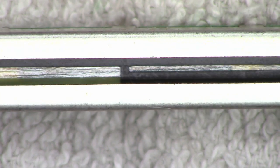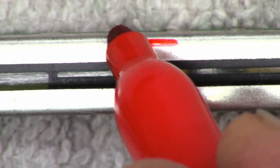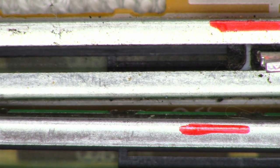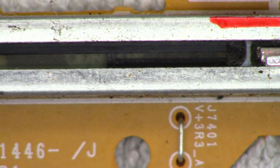Here's the new one oriented in the exact same way, and that's how it's going to go on. I'm going to go ahead and make a mark on the pot where the connector should be — about right there. Now these two pots should be virtually identical upon reassembly. Let's go ahead and zip this one off the board and solder the new one on. We'll put it back together and hopefully this will take care of the customer's issue.